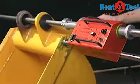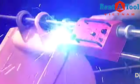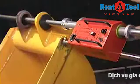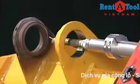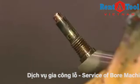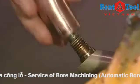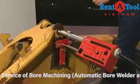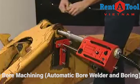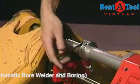Once centered using a boring bar or 1 1/4 pipe, the tack nut may be welded into place. The torch and wire feed conduit are then put in place. With the welding wire fed through to the torch, the nozzle and tip are assembled and the system is ready for final adjustments. Measure the depth of the bore. Then adjust the torch length to allow for adequate travel.